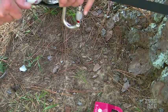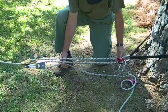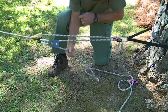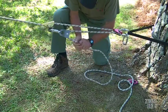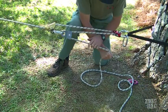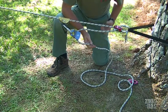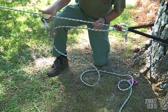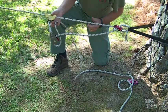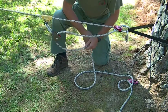We don't want to shock load this thing — if you start ripping the cover on a rope, it may be a total failure. Here's our Z-Rig, and I have the traction lock disengaged. So if I pull and release, I don't get any capture. But if I drop that down and pull, I'm actually pulling load — I've got a light load on the end of the rope. You can see I've captured that, and I can now slide this out, reset, and pull it again. I can keep doing that until I've got the load where I want it.